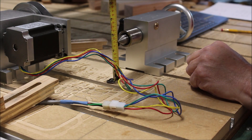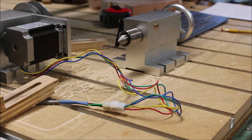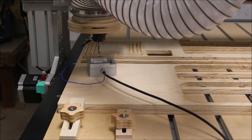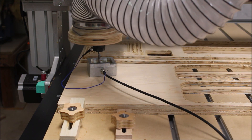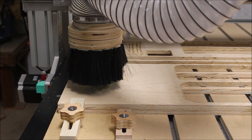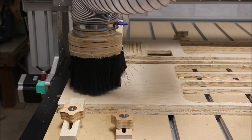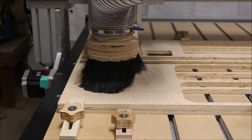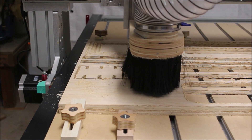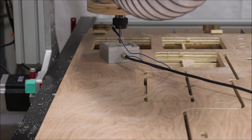There's only just a hair over two and a half inches on this, so I decided I would make some plywood spacer blocks to get it raised up a little bit. I made two spacer blocks out of half-inch plywood and two spacer blocks out of three-quarter inch plywood, so I could put a half inch and a three-quarter on the tailstock and the headstock and that would give me an additional height of about an inch and a quarter.